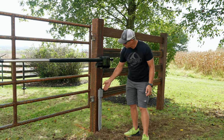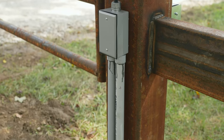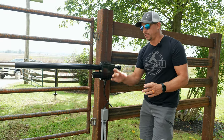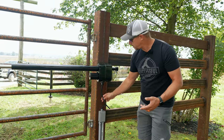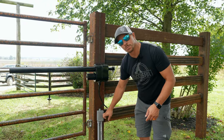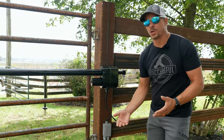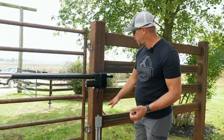On this side of the gate, we used a junction box so that we had a place to splice our wires. When we run all of our wires through here, there are some special ends we'll show you on the board — we have to cut those off and save a chunk of that cord. You can't fish that through the conduit unless you use a very large conduit. So you just cut this off, save those ends, and splice on your communication cable over to the operator. Anytime you make any splices, it needs to be in an accessible junction box — a lot of people try to bury this stuff and it creates a real headache if you have problems.